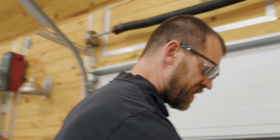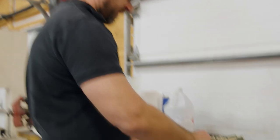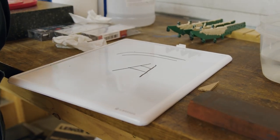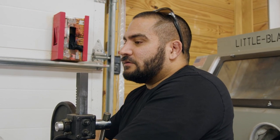You're slowly walking the edge further and further back towards the spine. Each time you walk back, you're getting into a thicker part of the bevel, so your sharpening angle gets bigger and bigger. That's great information — and it's not super difficult to find online, it's just confusing. One person explains it one way and another almost contradicts it. There's no single universal answer, but these are important principles to understand.